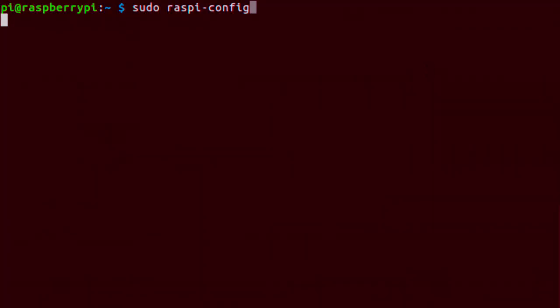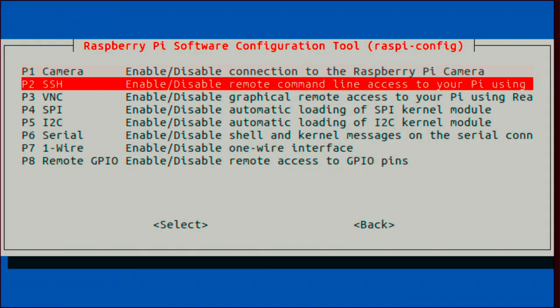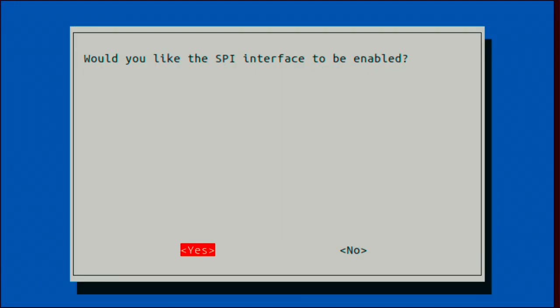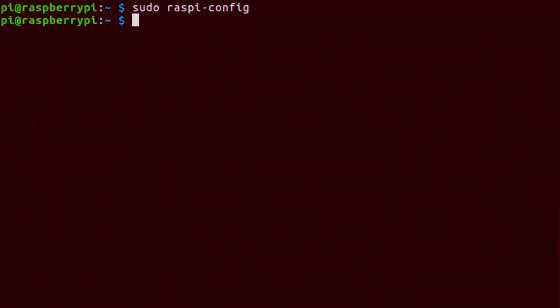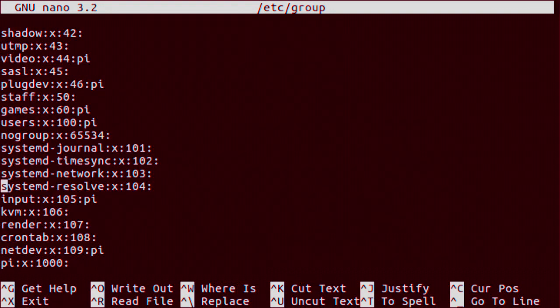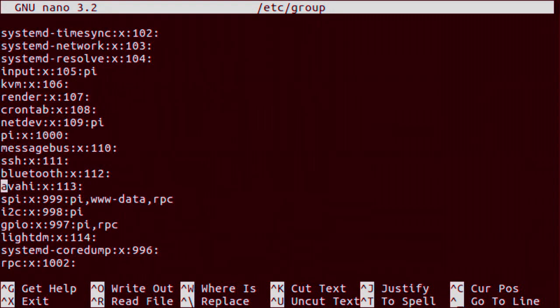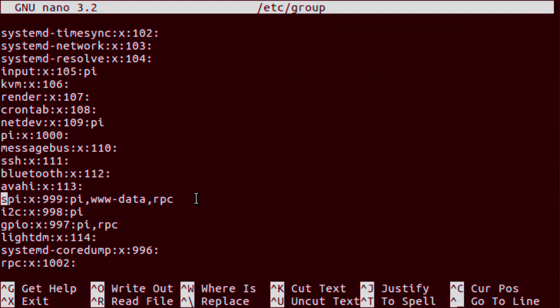If you haven't used SPI or enabled SPI on your Raspberry Pi, we need to do this to use the TH7. This is a simple job in Raspberry Pi config. Ensure that the username you're using is in the SPI Unix group — this is easy to do. We can edit using sudo the file /etc/group, go down to the SPI entry, and then you can add any usernames you need. PI will normally be in there anyway.